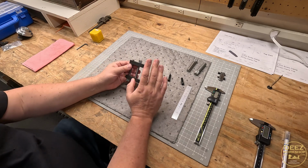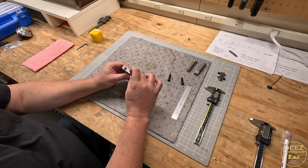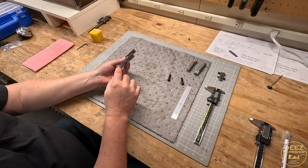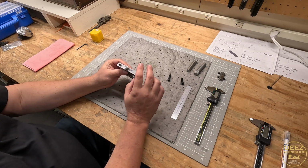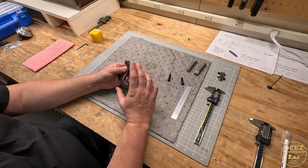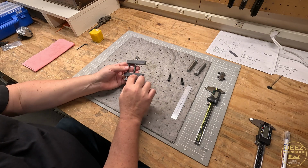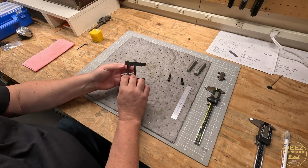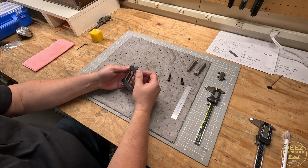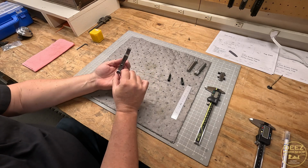But there we go. So I'm going to stop here, but again, I do need to clean up the little teats off of these things and cut my chamfers in here, and then either I'm going to lap it or use a face mill to clean up the rest of the sides. Again, I still do like the mill scale look of this. I may leave that. I probably will, because I just like it. But there we go. We're making some good progress.